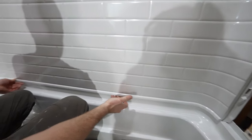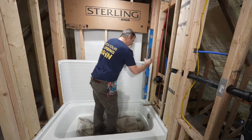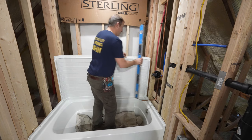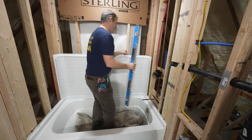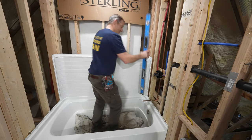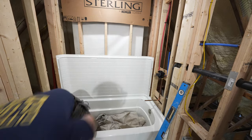Just line them up and that's really all there is to it. You want to make sure the bottom gap is about a 32nd of an inch groove here — make sure this is completely even all the way across and everything's set all the way in. There's no caulking involved. Important note here is making sure these walls are plumb. Put a level on the edges here — make sure it's plumb. If your wall was leaning, you can shim this out with a couple of shims. Just pay attention that it's level, and then all we have to do is screw this into place.